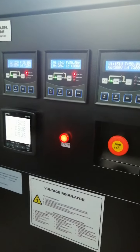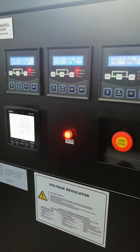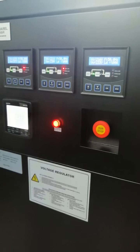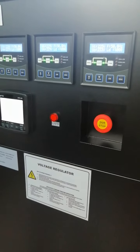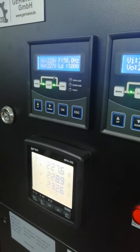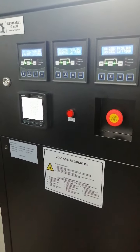The device gives a low voltage alarm with a red light and enters protection mode thanks to the contactor. The red lights are shining. Now let's return to the normal range — when the input voltage comes back to normal, all lights turn green and the red light goes off, because our input voltage is back in the normal range of 170 to 265 volts.